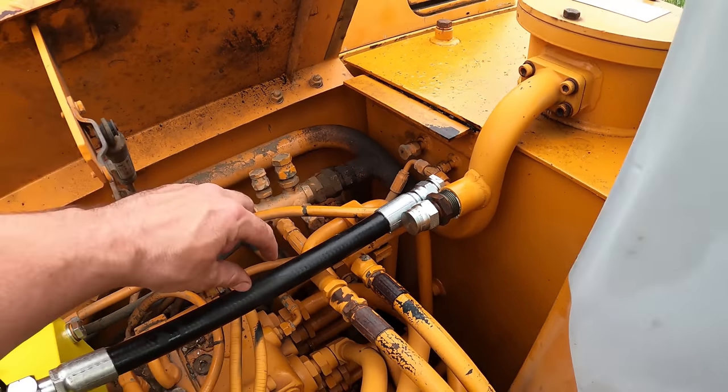Best we're gonna get. There's about a quarter inch gap in there right now, but you know what? That's really thick steel right there, and that'll help heat up the weld. Anytime you have a big gap in between two pieces of metal, it'll help the weld get a lot hotter.